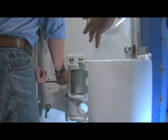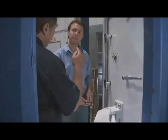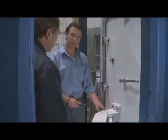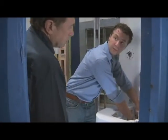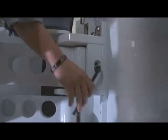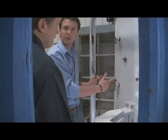So we're going to loosen this screw. Do you usually start with the one on the left first? Depending on which direction you want it to go. So if we're moving it towards you in this particular case, we're going to start with the left — correct, on facing it on the inside. You want to loosen this screw, then reach inside here and tighten this one. As you move it, the door will come across. So that moves the door to the left as you're tightening that up — correct. The door is moving this way very slowly at each turn of the screw.